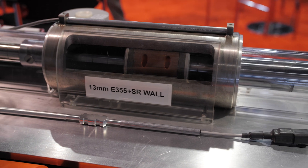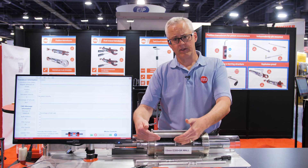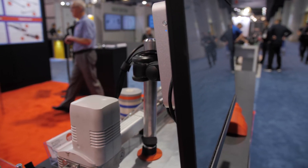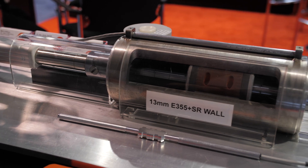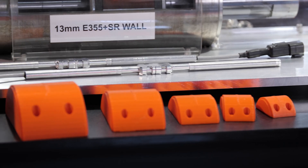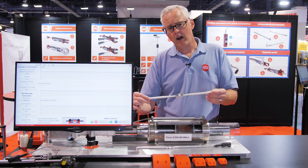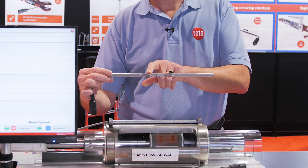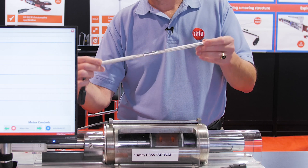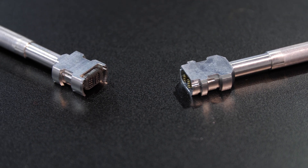Here we're showing our external solution, where the magnet is placed inside the cylinder. It propagates that magnetic field through a carbon steel wall to communicate with the sensor externally. What's new at ConExpo 2020 is our design capable of being built up to 130 feet in length. We've greatly reduced the size of the junction portion, which allows us to fit in tighter and tighter envelopes — like the box sections in a telehandler or an aerial work platform.